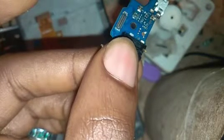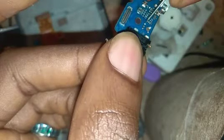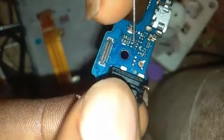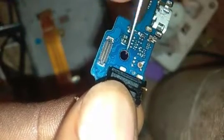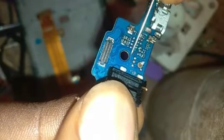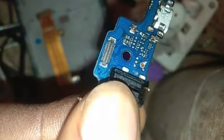This terminal here and this terminal here are the minus — that's the GND, the ground. While the first terminal and the last terminal on the side with three terminals, those are the positive. The mistake most people make is that they only connect one positive side to one negative side without bridging these two positive terminals together. You have to bridge the two together — if you don't, and connect only one positive and one negative, it's not going to work.